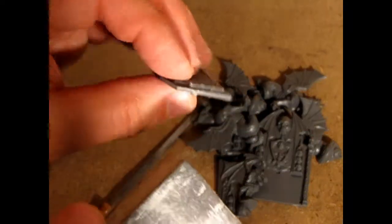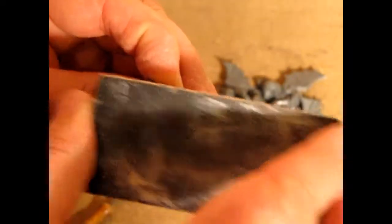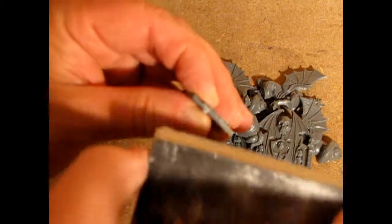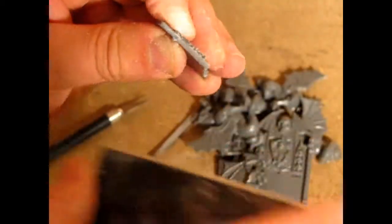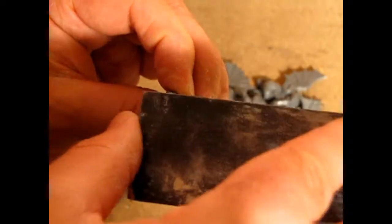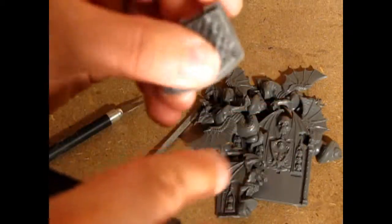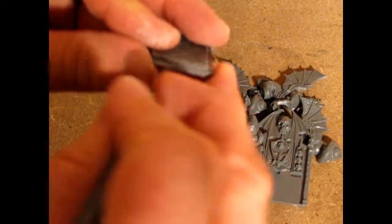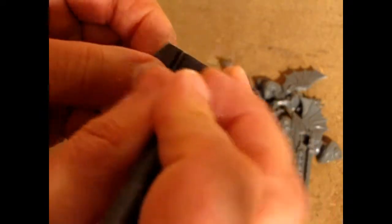Cross-sanding. Cross-sanding is a technique for accuracy in your sanding. You would first sand in one direction. So as you can see, this is crossing that piece that way. So you sand this way for a little bit. Then you reverse your direction. Let's see. Go this way. So if I turn the part over, it'll cross the pattern of the sandpaper. And this is good if you're doing model cars and that sort of thing, or panels with a long line, because cross sanding will actually correct your sanding pattern, so you don't get any dips or anything like that in your project.